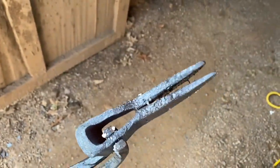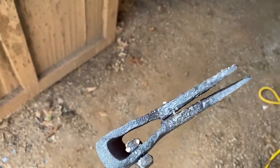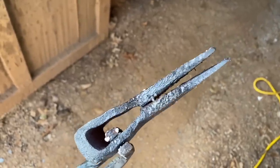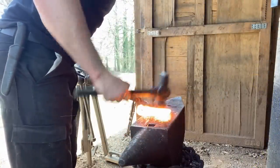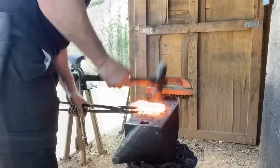The most important thing right now is getting those shoulders to line up — don't worry about the shape of the eye yet. We're looking pretty good, so we'll go in for the first weld. We only really want to weld back near the eye right now so we can still get the bit in. It's coming along — first weld, here we go, staying back near the eye. Second weld, here we go.